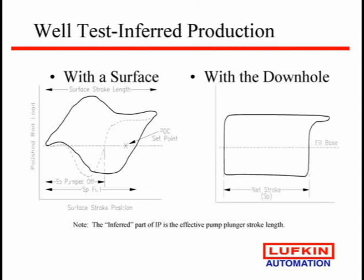Every stroke, the controller looks at what the pump stroke is, so we know how much fluid we moved, and we can show you daily how much production that well is making. It lets you put in a water cut as well. How often do you normally get a well test — once a month? This way, 24 hours a day, you can see what's happening. We've added new features that take the downhole card and show how much shrinkage, gas, and leakage is present. We allow you to do a valve check and are doing PIP calculations for even greater accuracy. We've gotten this approved in Canada as a well test and certified in Russia as a true well test, and we're working with the Railroad Commission to try to do the same thing here.